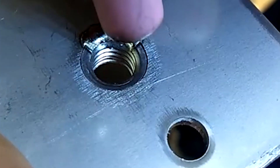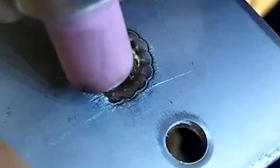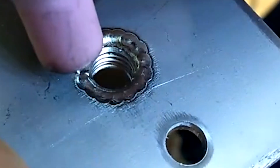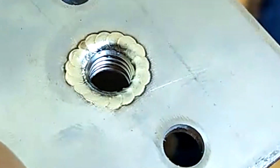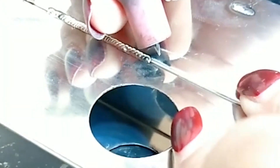The second point is the difference in deformation. Thin plate welding is not easy to deform because the welding temperature is much lower than that of the argon arc welding machine. The cold welding machine has a great advantage in thin plate welding — deformation is very small. The thinnest manual welding can achieve high quality welding of 0.2 mm plates, and compared with the argon arc welding machine, the cold welding machine is not easy to burn through.